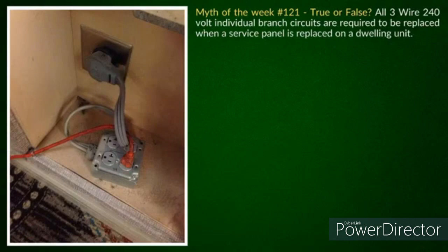It tells you for the ground rod number 6, concrete encased electrode number 4, and for ground ring number 2. That's done, and that's in 250.66 A, B, and C, and then that refers you back to 250.52 A, 2, 3, 4, and then A5. Okay. Sorry, to make you go down that little rabbit hole real quick. Oh, that's okay. I don't mind.